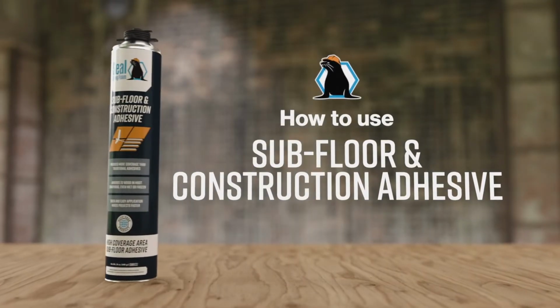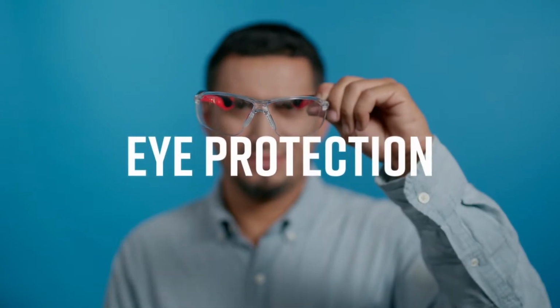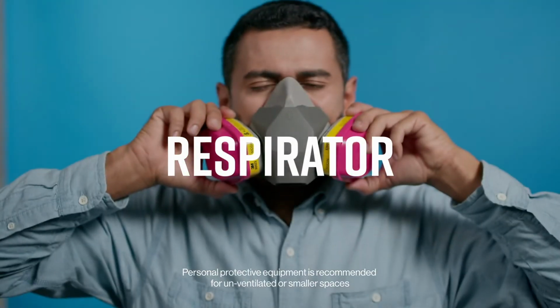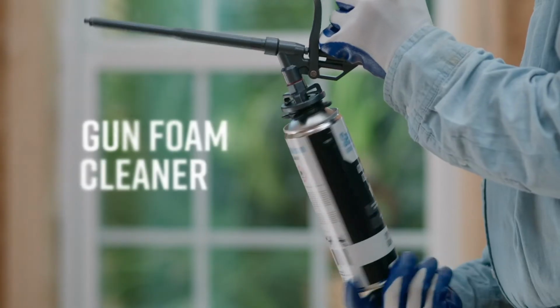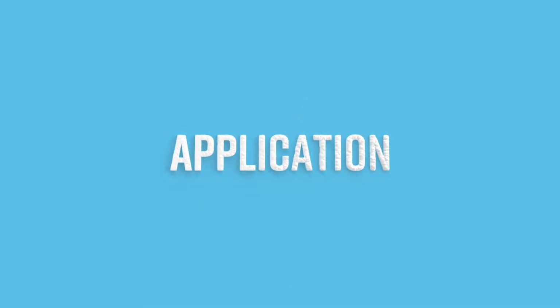Here's how to use Seal Spray Foam Subfloor and Construction Adhesive. Here's what you'll need: eye protection, adhesive repellent gloves, respirator in some cases, and a professional gun applicator. A 40-inch long gun is available to save your back in subfloor applications. You'll also need gun foam cleaner or other acetone spray. And here's how to use it.